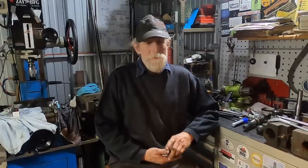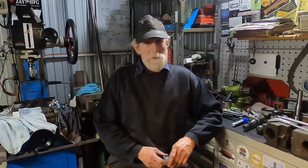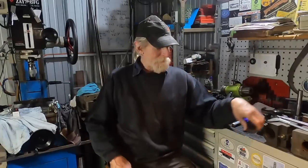Well, okay, we better bring this one to a close here. Actually earlier on today I was over at the new shop just doing some cleaning on the lathe. I've pulled the 10 horsepower motor that drives the lathe. I pulled the motor out, stripped that down, removed the bearings. We'll cover that in another video. But while the motor was out, I've just been getting in there with the kerosene and giving it a good scrub up, all in the casting area below the headstock.